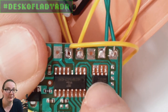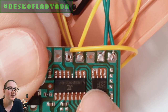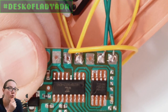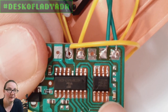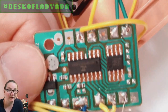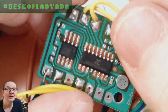It's a very low cost 8 megabit flash chip - this is probably where the program memory is stored externally. I don't think this is the audio storage because it doesn't make a lot of sense to spend money on SPI flash for audio, but it could store both program memory and audio recordings. Finally, looking at everything on the board: there's no LDO, there's the motor driver, there's flash memory. If you Google this number you'll find the datasheet - it's just a low-cost flash memory chip.